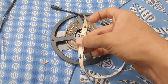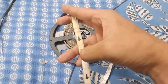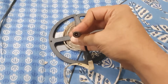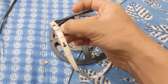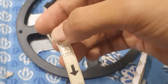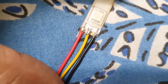In this video I will show you how to control this LED with Arduino and Bluetooth. First we need to cut off the portion with the pre-programmed chip, because if we do not cut it the whole LED strip will be controlled by that IC only, which is not programmable. We have two input lines on it but we need three input lines to control it.